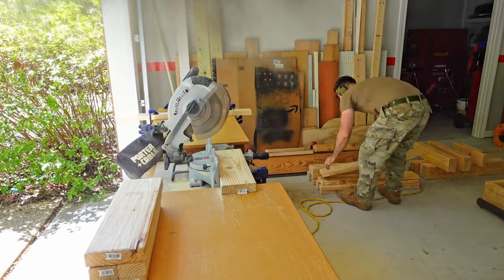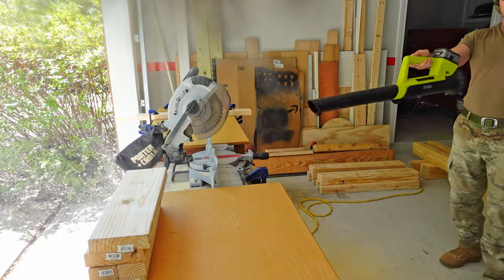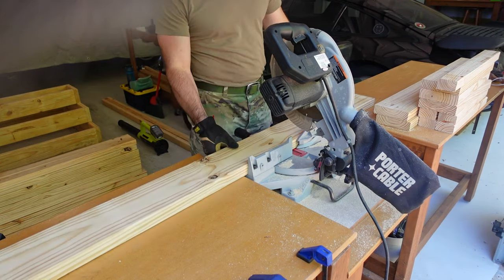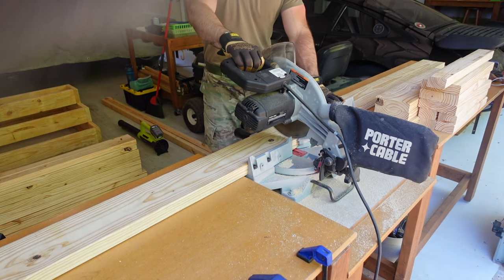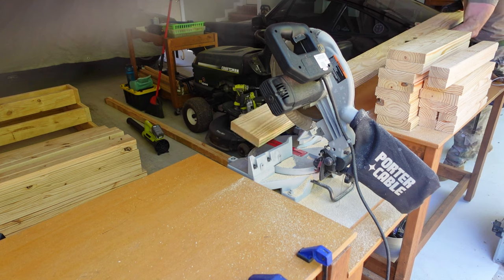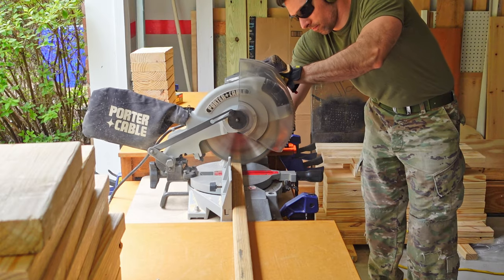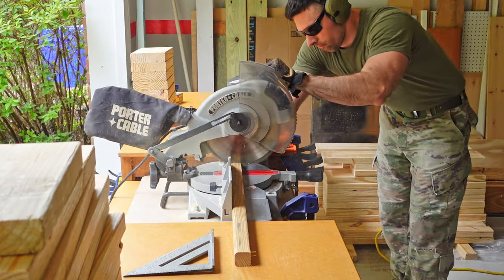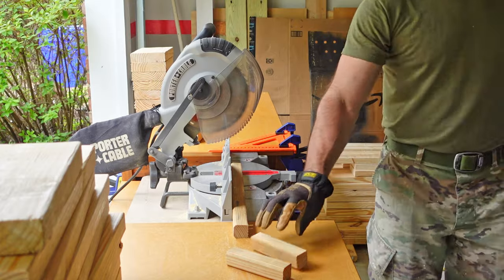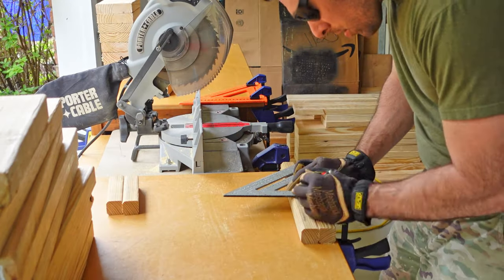Once I was happy with the dimensions, I bought the wood and started cutting. The design is simple — a square that is 39 by 39 inches, and each box is built out of two by sixes and two by threes. I decided on five boxes total because that fits the available area well. Since I had a lot of repetitive cuts, I set up a board stop and knocked off the cuts one after another — it took about an hour to cut all the boards down.